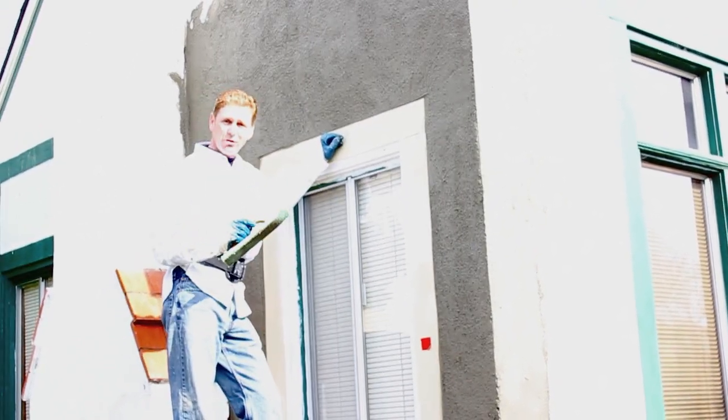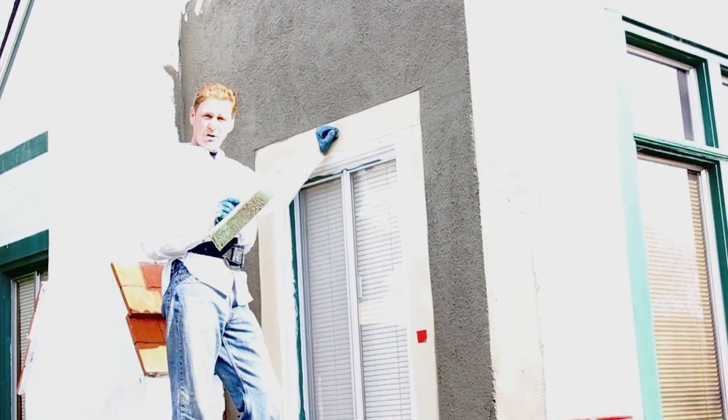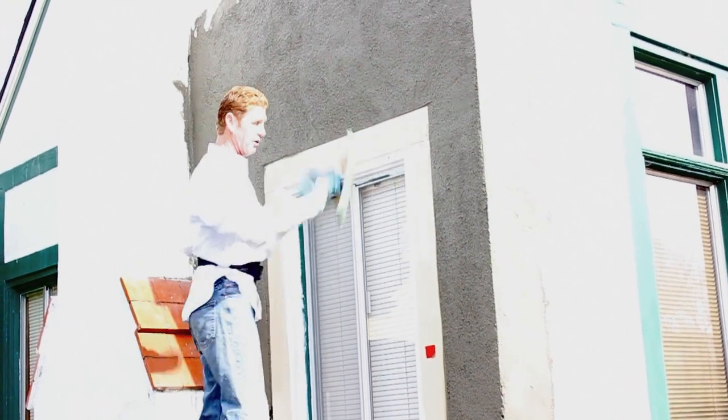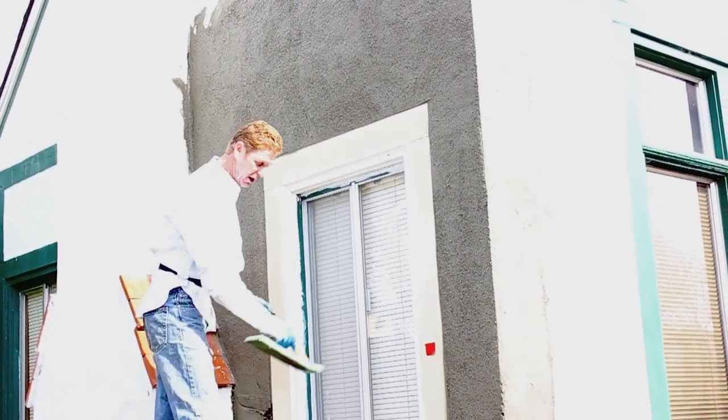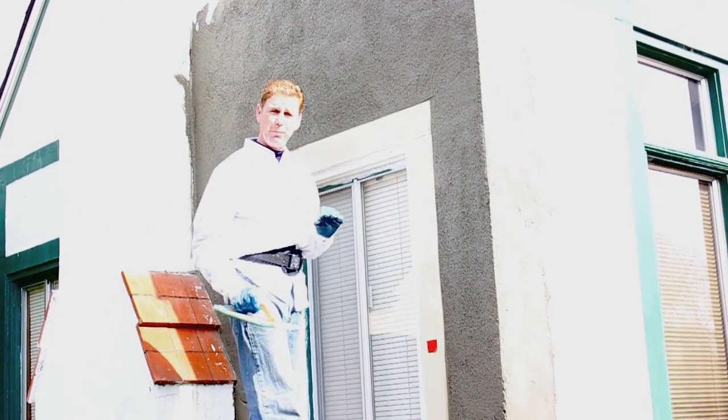When you do the one coat system, scratch and brown the same day, you will hustle. So if you're not certain about this, don't even try this. Go conventional, scratch and brown. Anyhow, we're going to tear this down. I'm going to get out of here, spread out all the rest of the cement because it's getting hard. We have only so long to apply this.